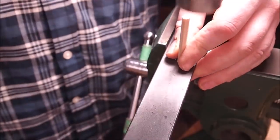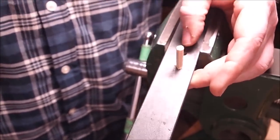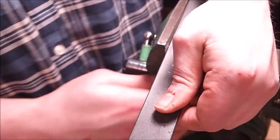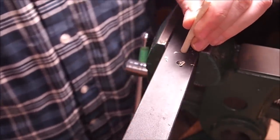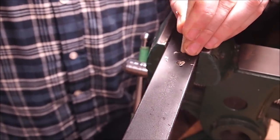Since I'm moving the bridge, it's a good idea to plug up those previously drilled bridge pin holes. I'm using a piece of spruce and banging it through a swage block, which is just a piece of steel with a set of different diameter holes drilled through it. Tap it on through and you end up with a custom-fit dowel.